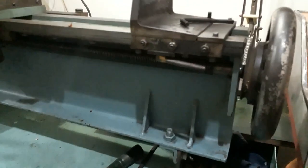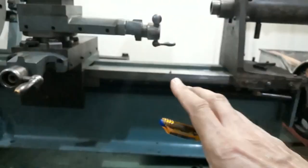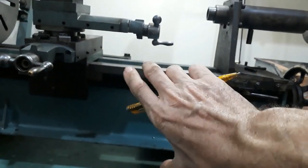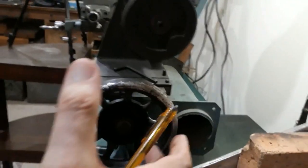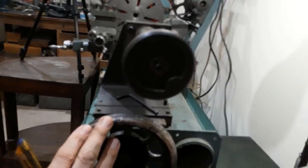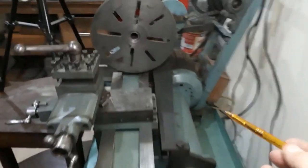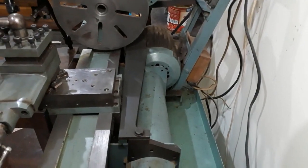So just to recap: here is the I-section beam — great at resisting moments in the vertical direction, but not so good at resisting moments laterally or torsion. That combination of an I-section beam, a torsion tube, and this strut solved the rigidity problem for me.